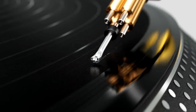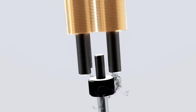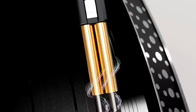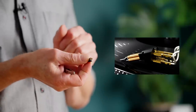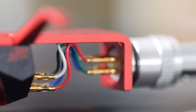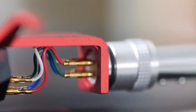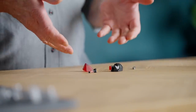And why we will have the magnet sitting in between here and moving. In the coils, we will have a voltage generated — a signal. That signal will come out at the very end of these four terminal pins, so that we can connect the cartridge to the rest of the system and listen to music. So we have now looked at the moving magnet, taking it apart to see what's inside and to understand how it's working.